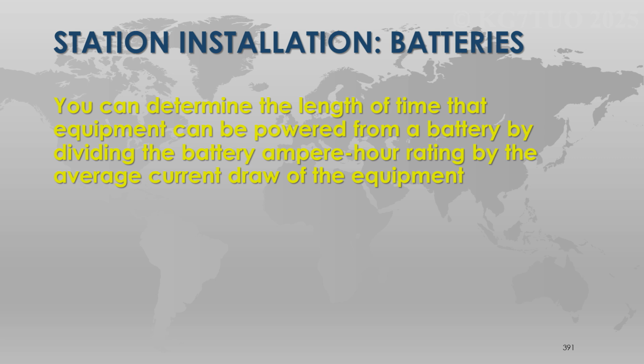Well, you've got a month's worth of battery? I've got 3 or 4 months' worth of battery. I charge about every 3 to 4 months. So, convert it to watts when you're doing your calculations. It just makes things easier because you might be at 13.8 volts and you might be at 12 volts. You need to know how many watts. And that's how you figure out how big of a battery you need to run a certain number of hours.